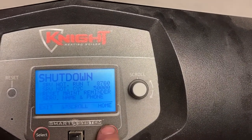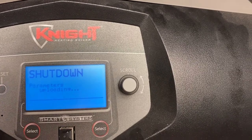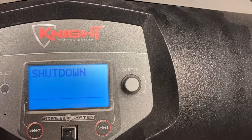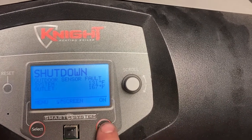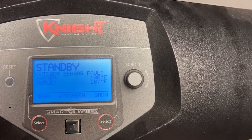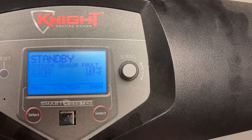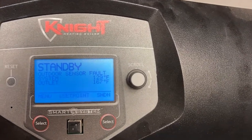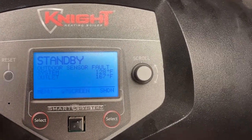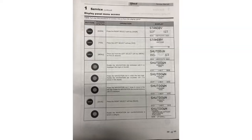And we're good — now we hit Home. That's saving all our parameters. Then we're going to hit On to turn the boiler back on. And that's it — that's how you get rid of the little yellow lit-up display saying maintenance reminder. Hopefully this helps — bye!